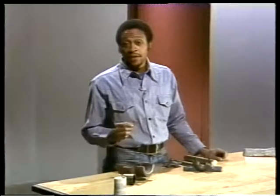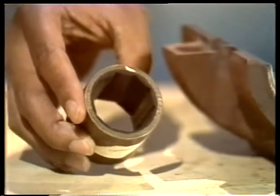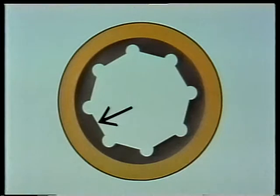The non-metallic materials used most often to make a bearing are rubber and plastic. Wood is also used occasionally, but far less frequently than it used to be. Rubber is often used in a situation where it's possible for grit to get into a bearing. It works particularly well when the bearing is lubricated with water. This particular one is known as a cutlass bearing — these grooves allow the water to flow through the bearing. Any particles of grit that get in are pressed into the soft surface as the shaft rotates and eventually carried out along with the water flow.